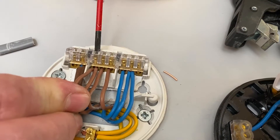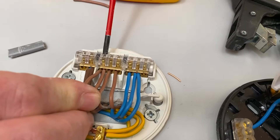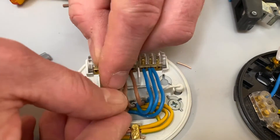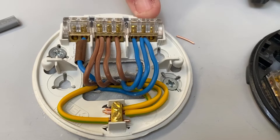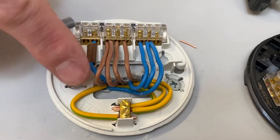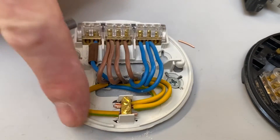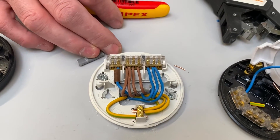So what we've done is we've managed to pick up from a light fitting that looked as if it's fully populated. The terminations are nice and tight. We've got three in our neutrals — the outside neutral will be for our flex — so three neutrals, four in our loop permanent line connection, and our switching line. This cable that we've added goes off to another area, maybe an outside light, a loft light, or another room, and brings the supply — permanent line, neutral, and CPC — into that location so you can continue on the lighting circuit. I hope this video has been some help.